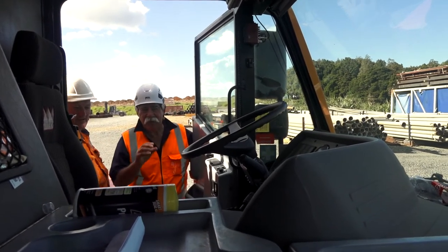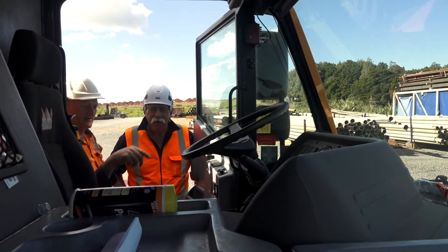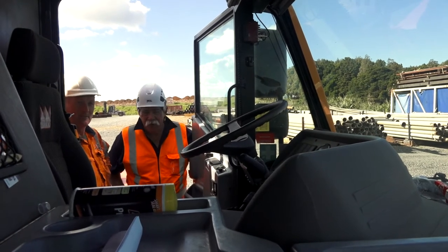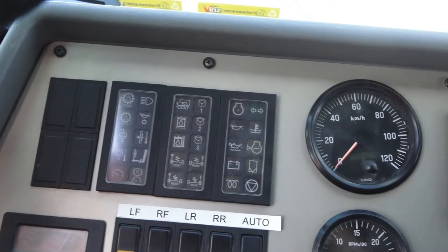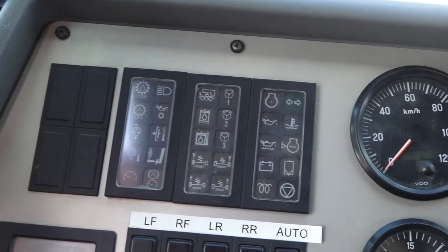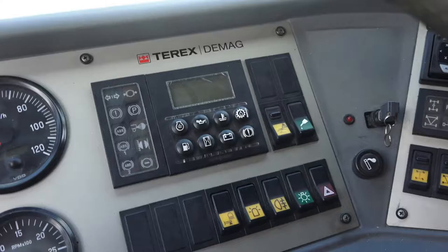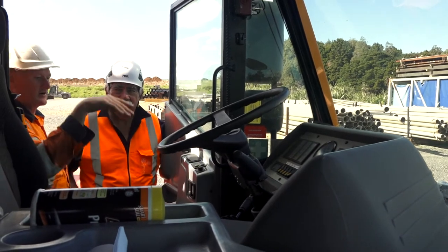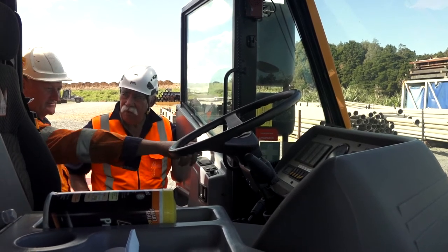Do the basic controls connect to the crane or is the crane independent? The crane is independent. There is a certain amount of power that connects them both, but nothing for road travel or crane operation. Once we're in road mode, we've got suspension settings here. We can set our ride height on these controls, push the auto button and it puts it to the automatically preset ride height for road travel. And on rough ground or sites, we can set them independently - raise ourselves higher or lower as needed.